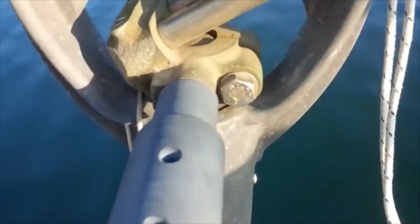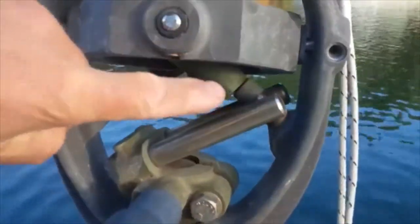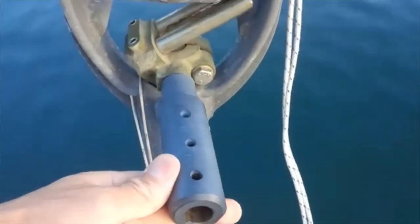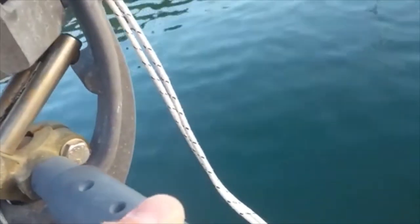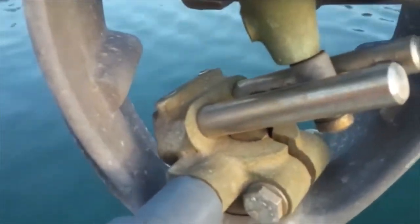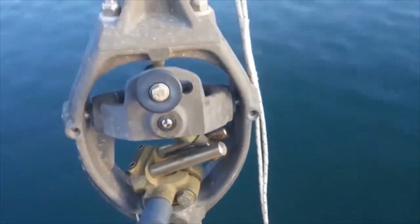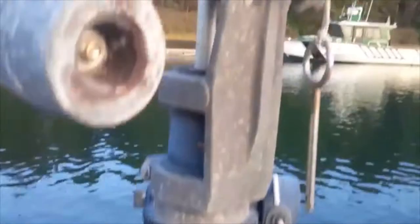So this is the actual gearing now, and you can see the actual action - the mechanism there of this post. The wind vane rotates this post, which then acts like a gear and turns the rudder. On this setting where the post is furthest away up this fork, that's the least amount of rudder. If you want more rudder, you move this setting further over to there, and now I get more angle - giving the boat more rudder. The neutral position is where that post is now vertical and the whole thing rotates around it, but the wind vane does nothing.